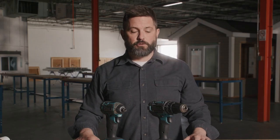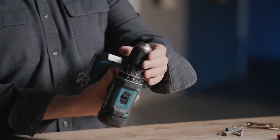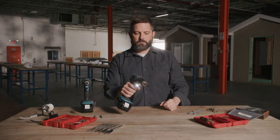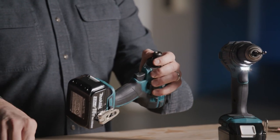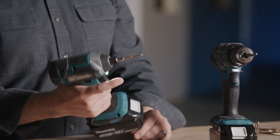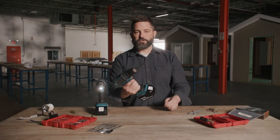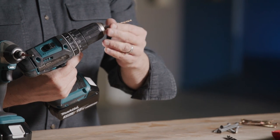One other difference between your cordless drill and an impact driver is the fact that the chuck allows it to be tightened around a smooth shank drill bit, whereas the impact driver does not. With an impact driver, you have to have a quarter-inch quick connect, which requires this sort of adapter. You pull the sleeve on the collar out and drop your bit in, allowing you to drill with an impact driver or use a driver. With the cordless drill, not only can you use the smooth shank bit, but you can also attach that quick connect the same way.